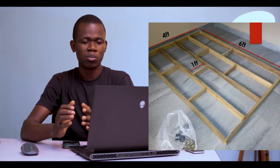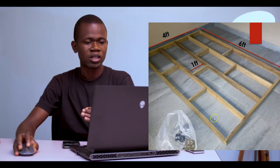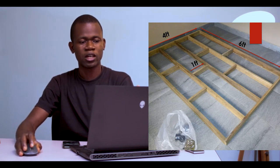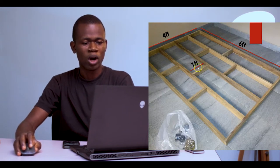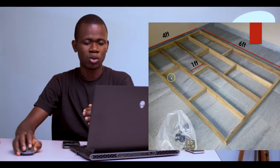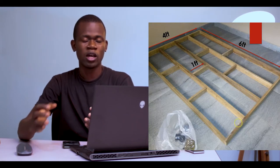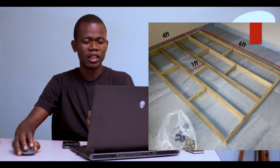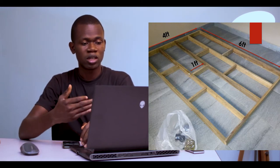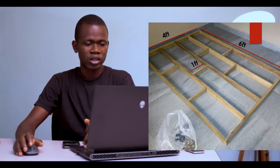Let me walk you through the process. What you see here is the base of the booth. The width is six feet, and then we have four feet on the sides — the left side as well as the right side — and then one foot for the inner joint to hold it firm. I cut the wood into different sizes and then screwed them together. At each joint I used the screw machine to drive the screws, and then I used corner brackets to hold them and make them firm. I'm going to make this PowerPoint available for download in case you want to apply something similar.